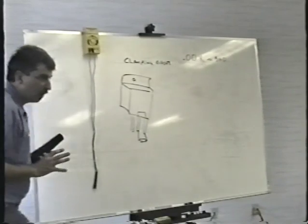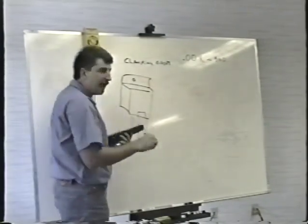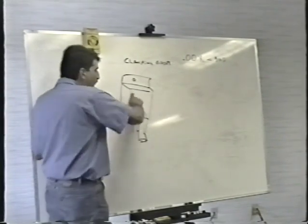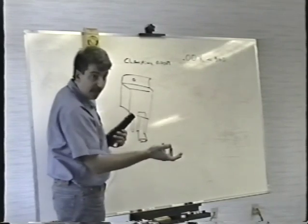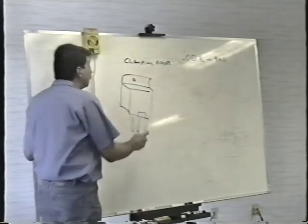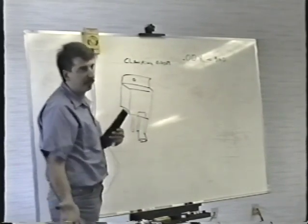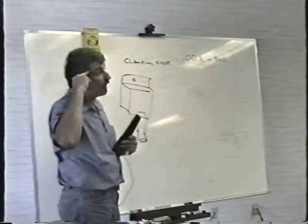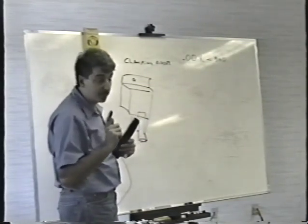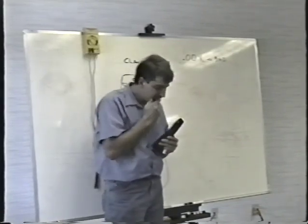So, again, one more time. You get to the power supply. The fuse is blown. First thing you do, turn the board over, check it from collector to emitter, beep, it's shorted. Unsolder, remove the transistor. When you get the transistor out, double check it, see if it's good or bad. And while it's out, double check the clamping diode, make sure that it is good, and if it's bad, of course, replace it. Everybody with me? That'll save you a lot of headaches right there, because that really confuses people. And we'll talk a little bit more about what the parts are, where to get them, in a second.